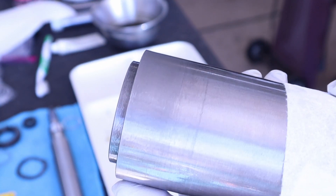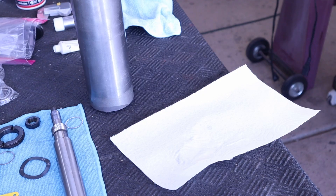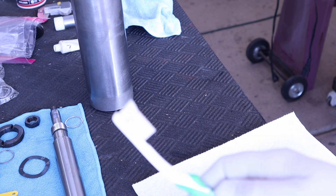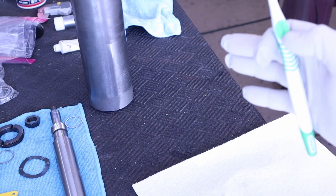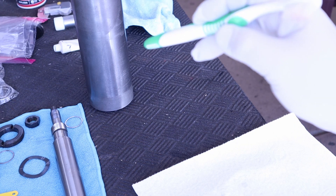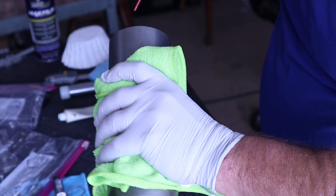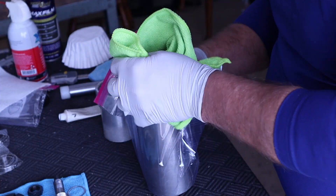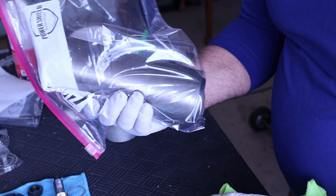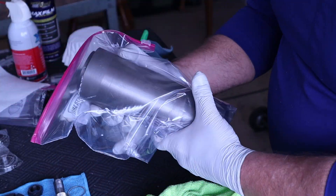This is one of the areas that was exposed and rusted — you'd just have to rest a hand on it. And then inside on this one, you can see there is a retaining ring — that's one of the backs of the bearings. I've blasted the toothbrush through the ultrasonic cleaner after wiping the threads down and the inside of the barrel of the quill body. What I'm going to do is take the brush again, re-brush the threads, blow it out, and then put it in a bag so the quill assembly is complete to the point where I feel comfortable putting it together. I've now isolated this — when I start assembly, I'll do a final blow to make sure there are no little bits of dust on it.